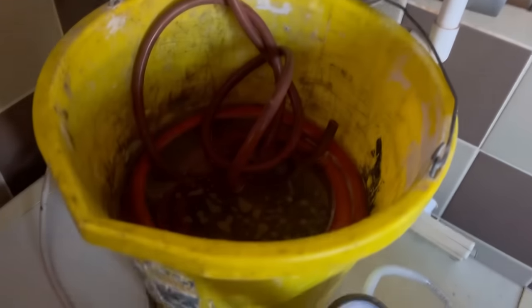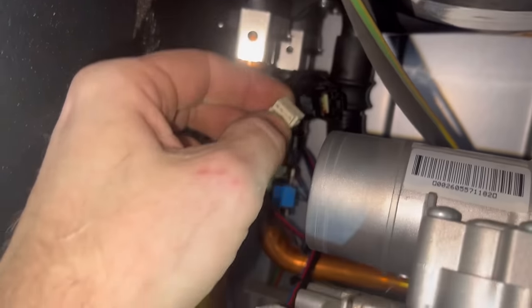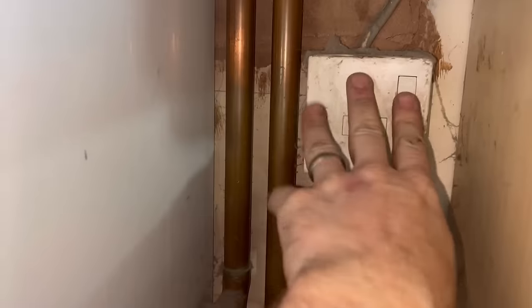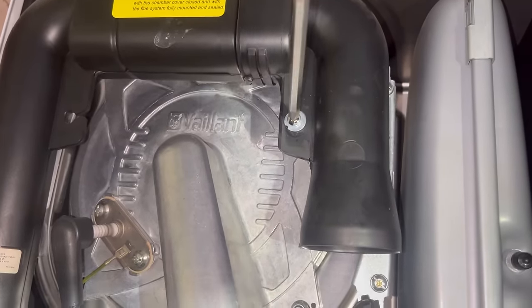You can actually test these — this is the old one. I've reconnected it. The boiler is all drained down so really we should get no pressure reading, but when you turn it on you can see it's reading about 1.5 bar — so yes, it's a faulty pressure sensor. That's a good way to check. Now disconnect the old one, put the electrics on the new one, and when we put that back on the pressure will read from zero. You can see it's showing 0.1 and rising — once it gets to the right pressure the boiler will kick back in.